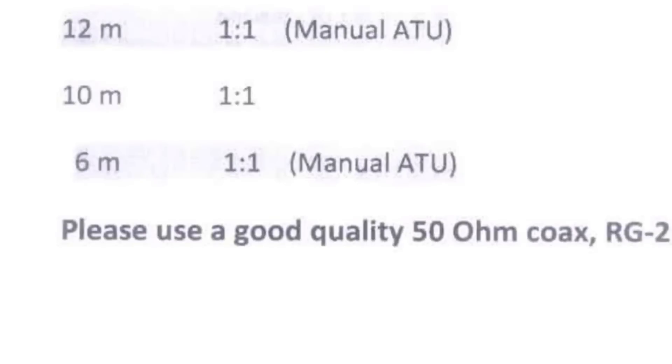That's really just a gimmick to sell it. Listen, you can't defy physics and nothing is magical that won't work without a counterpoise. What they're actually doing is using the coax as the counterpoise. If you look at the manual when you buy these things — I know with the Euro Sigma Com HF360 it says right there, please use a quality 50-ohm coax. Everywhere you look on the internet, everyone's telling you this thing needs at least 50 feet of coax because what it's doing is using the coax as the counterpoise.